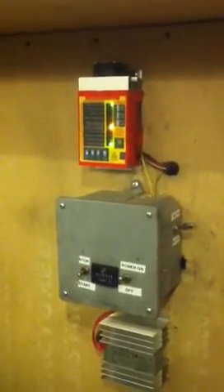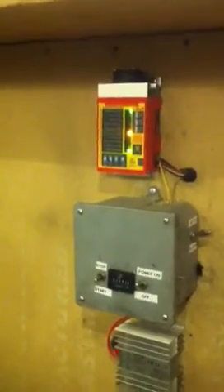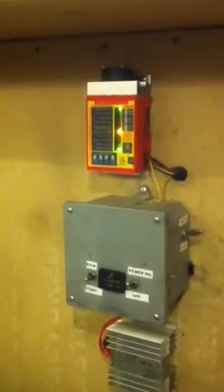I've also taken the bridge rectifier out of the alternator to get some of the heat out. I found that we were about twice as efficient with an external rectifier than with the internal rectifier, plus we get some of the heat out of the compartment in here, which is a good thing because it puts the heat into this room.